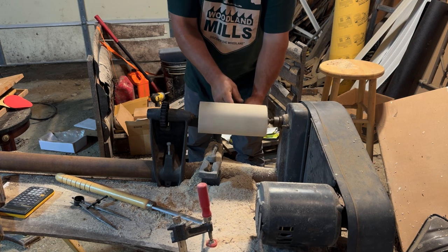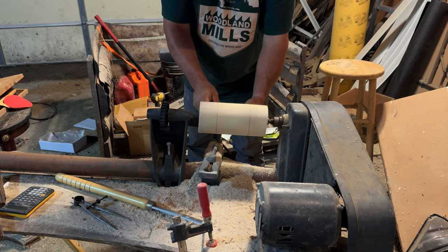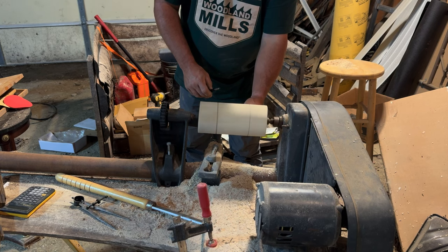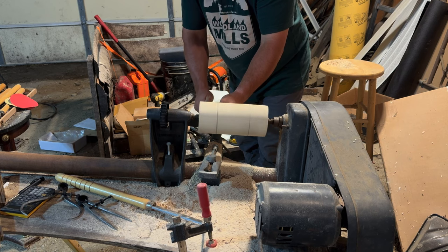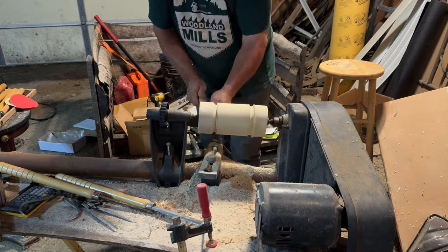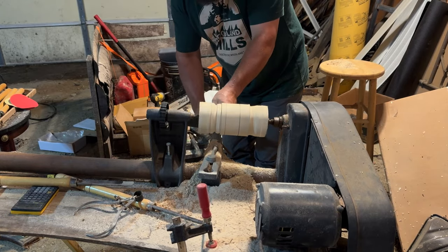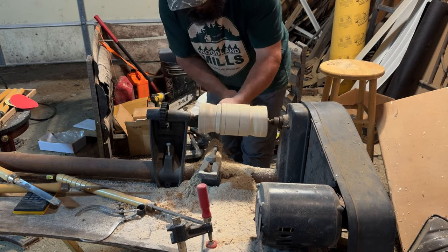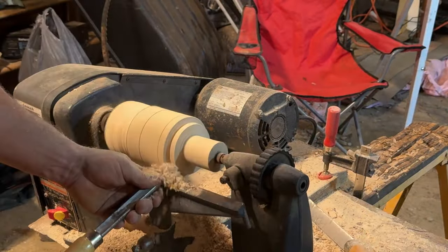At this point I've already turned it down to three and three-quarters inches. Now I'm going to put a mark at the top and at the bottom — this will be the height of my acorn, another three and three-quarters of an inch. This is where we start giving it a little bit of shape — I'm going to start removing some material at the top and the bottom. Now that I've got a little bit of definition, I've added lines to the bottom of the flat spot and the center of the arc at the bottom, which gives me an idea of where I need to take measurements and what material to remove to get the shape I want.